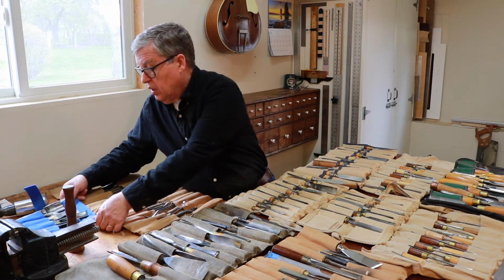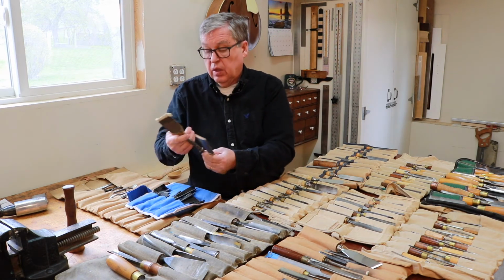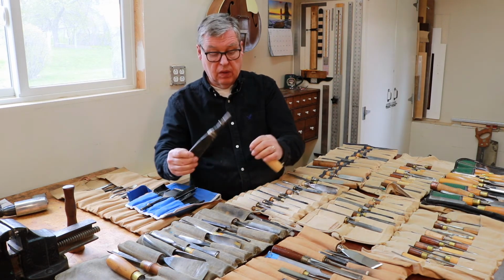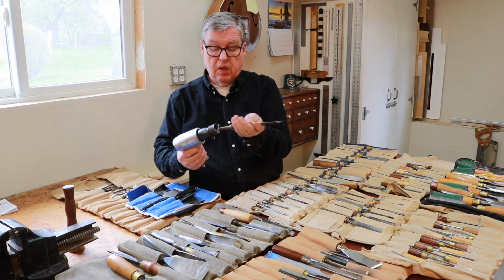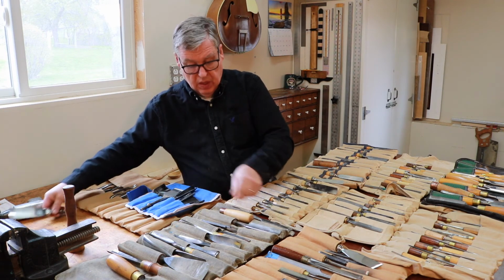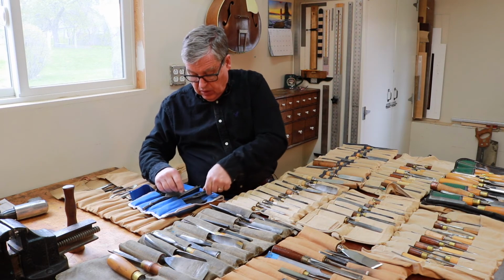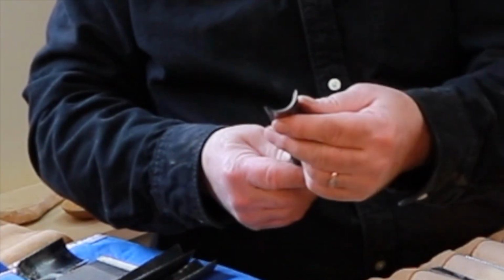Now here's something that's very specialized. I had a big job that was exterior work. I ended up cutting and having these welded up. I cut some original, some full-length carving tools. This one here will come off like that. I still use it as a regular gouge, but this one is also used in an air chisel. So I won't run that now, but it's quite noisy, uses a lot of air, but it's good for roughing down. I didn't start out with that. I just started out with mallet and chisel, but that does save some time. I had a welder make some up for me, and then I had regular tailpipe cutting tools for air chisels, and I had them forged by a blacksmith.